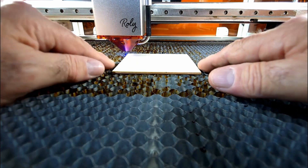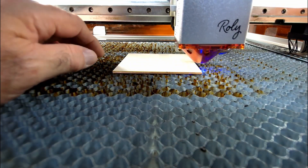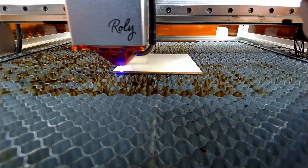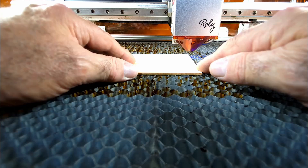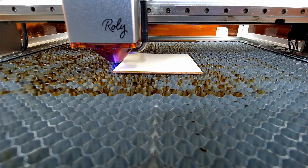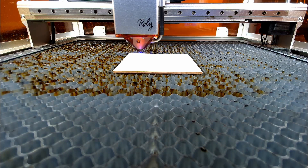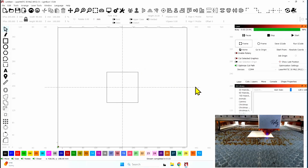I think that's it. Maybe I've moved it a little too much — that's right on the inside. This one is slightly out. That one looks pretty good. I'm just going to let this keep framing so that I know that it's in the perfect position. Now I've got at least three sides that look perfect, and I think that one looks pretty good too. We're just getting that beam right on the inside edge of that wood, and that's why I deducted one millimeter. I'm thinking that is pretty close to perfect. Let's come back into LightBurn and say OK to stop the framing.